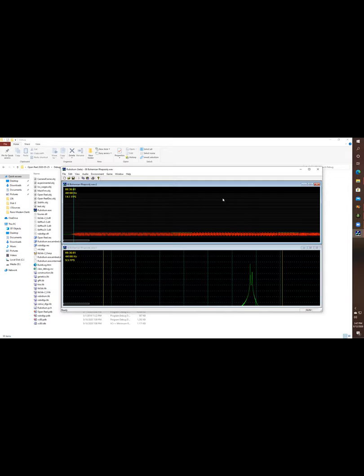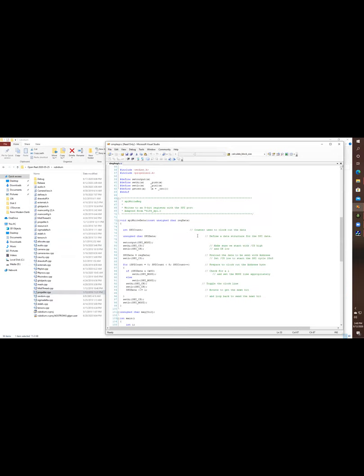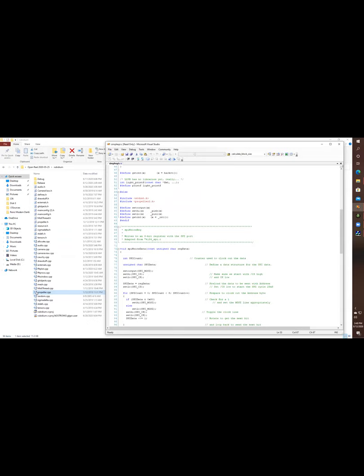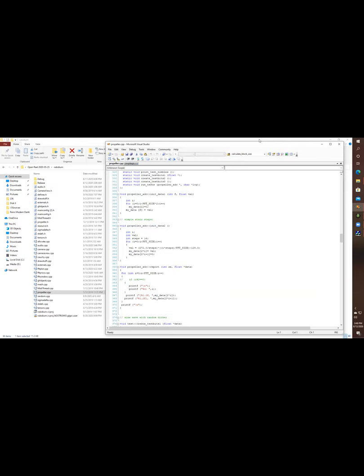I need C source and Spin source so I can be talking to the Propeller and not just running simulations. This goes back to the Sigma Delta ADC breakthrough days. The only thing that's not seen is: there are about 400 lines of assembly, 386 code that does the parsing. But that parsing could be done in a high level language — there's really not that much to it. All you're doing is uppercasing stuff and then looking for matches against known keywords and names that the user has defined. If you see a dollar sign, you've got a hex number coming. All things like spaces, tabs, commas — that's all white space. It's only looking for keywords and numbers, and single quotes to define strings.